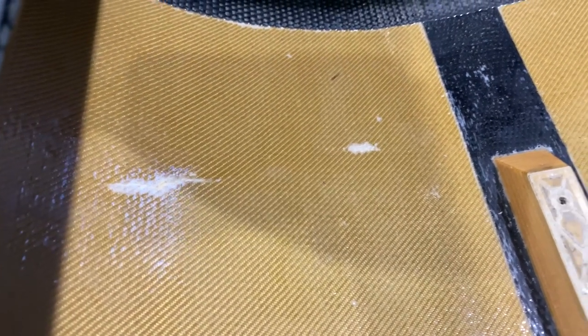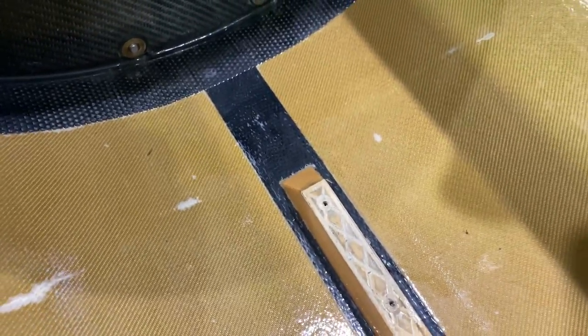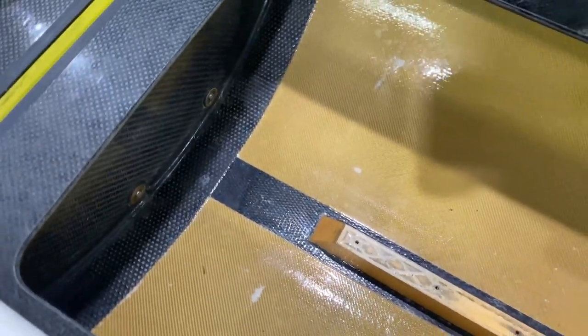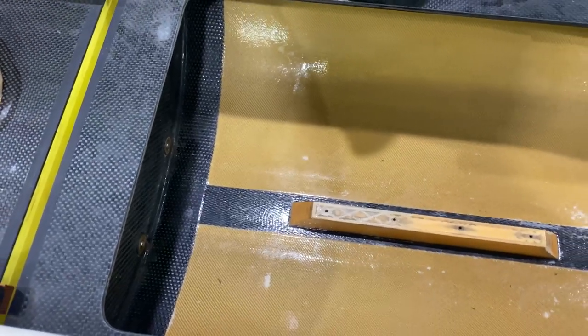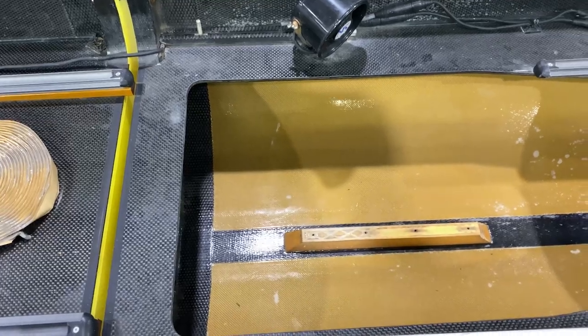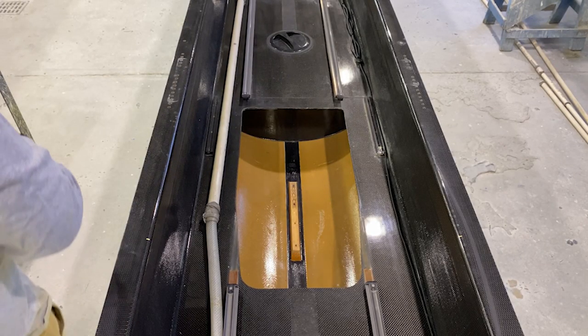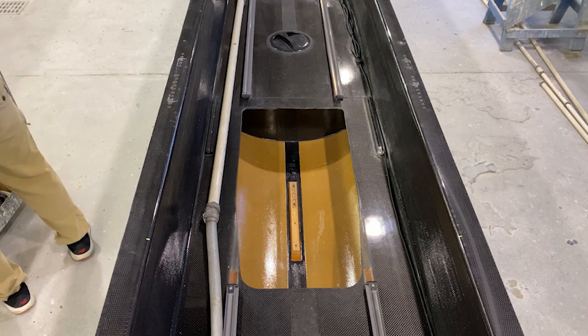We believe the cause of this is that the boat occasionally is riding between two large waves where the bow and stern are supported, but the middle of the boat is in midair. So you can imagine it's almost like the boat is in two slings, but it's still filled with rowers. We will be reinforcing these footwells with brand new carbon fiber lamination to prevent future catastrophic failure.